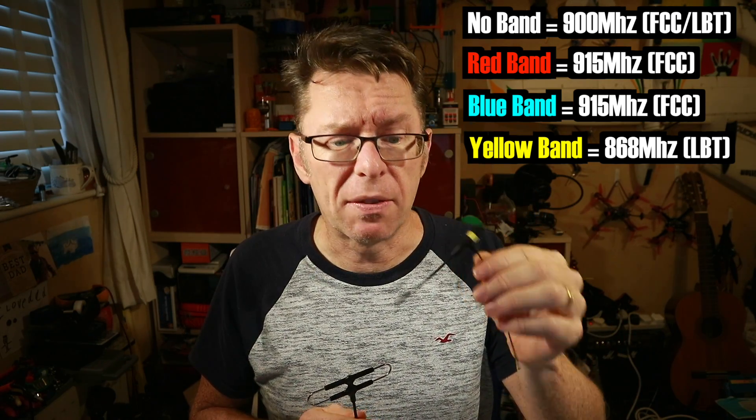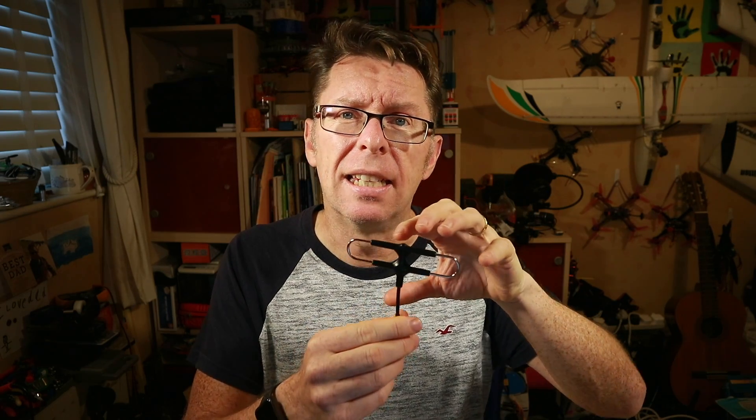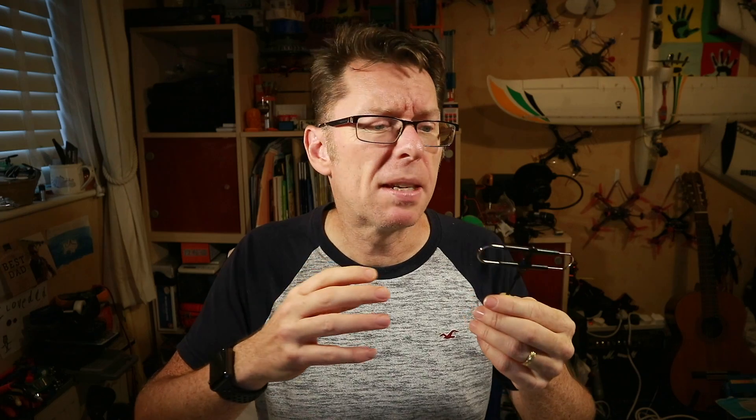I don't know if there are any T antennas that are blank with nothing, but if they exist they might be tuned to 900. Is there any reason to panic if you've got the wrong one? Not really. Here's my FPV antenna — it covers a wide range of frequencies, with a central frequency that gives more gain, but it still works on all the others. Same with this: tuned to 900, highest gain at 900, but it still works at 868 or 915. I keep hearing 'you'll get a failsafe using the wrong antenna' — this isn't something that will be bad at a few hundred meters or even a few kilometers. The tuning really matters when you're pushing five or ten kilometers. So don't panic, but if you're buying one now you can get the correctly tuned version for your region.